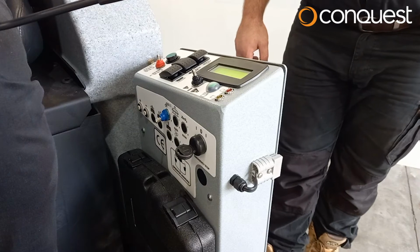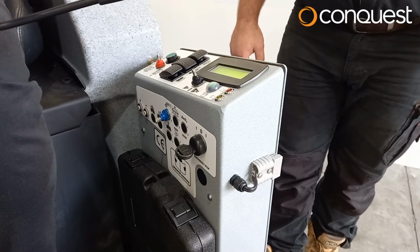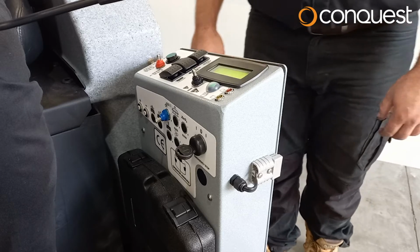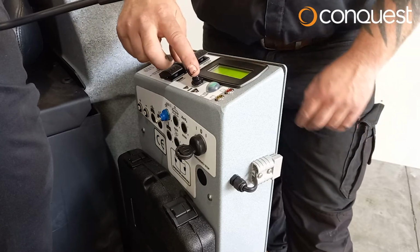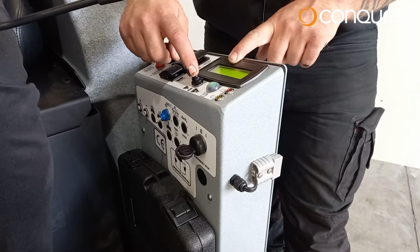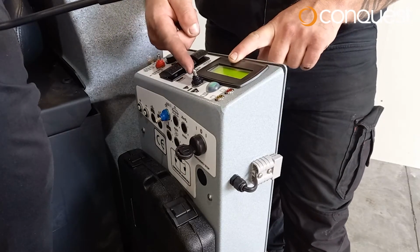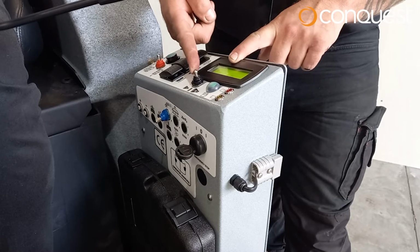Step 3. Set the down pressure. The down pressure button is the one located near the hour meter. The black toggle displays 5 position icons on your LCD screen, allowing you to set the scrubbing pressure. Down pressure may also be automatically set and locked by management.